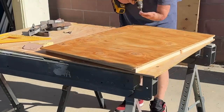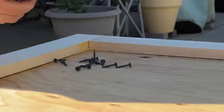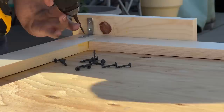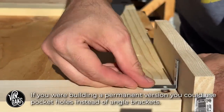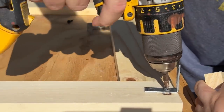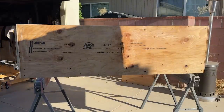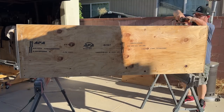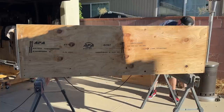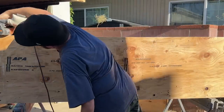A few screws to keep everything in place, and then I can add in some angle brackets. I'll be using an offcut to make sure the position is good, since the side panels are still a bit unruly. These angle brackets will allow for the crew to assemble and disassemble the frame to make for easy transport and will provide rigidity to the box. And after a quick assembly of the box off camera, it's time to correct any alignment issues by giving it a quick pass with my belt sander. I'll also use this opportunity to soften the edges of the boards, which should prevent them from tearing out or splintering if it gets dragged on the ground.